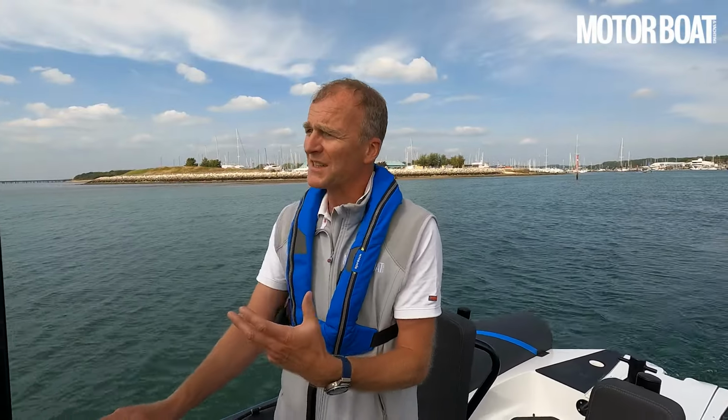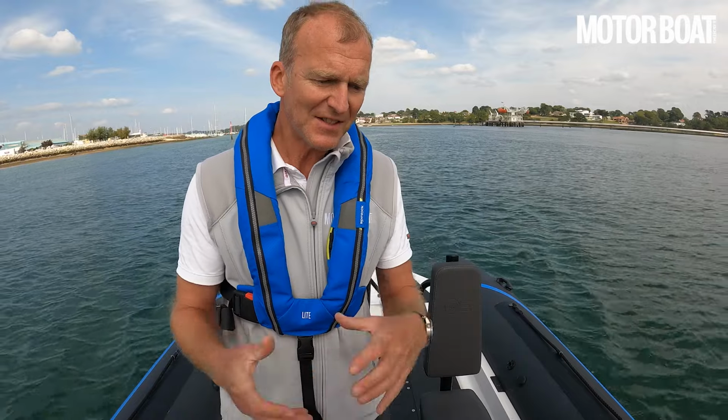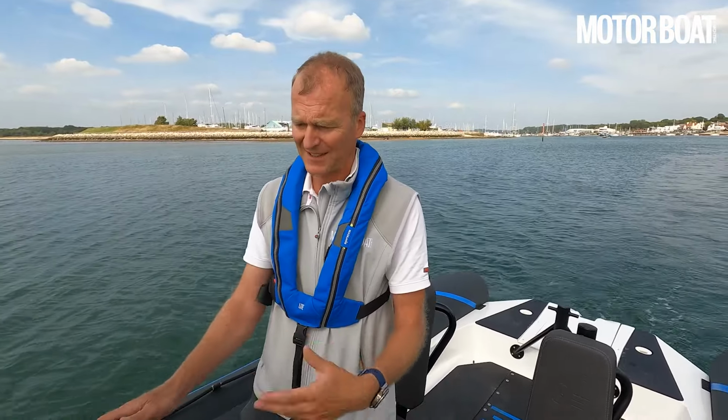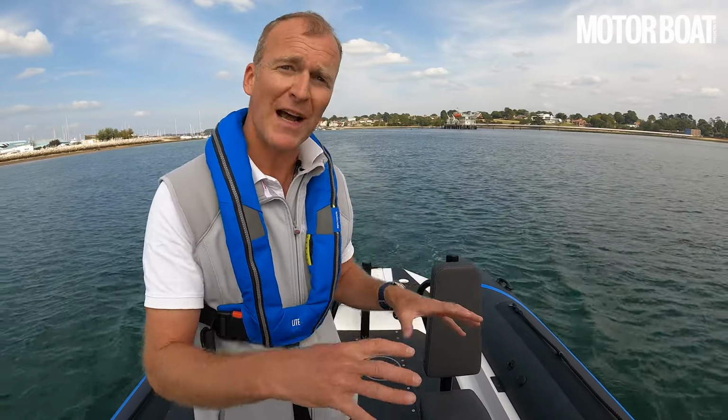So I know people are always concerned about the kind of range you get from an electric boat, but to be honest, the reality is it doesn't really affect you nearly as much as you think. Often when you're just using it as a day boat, you're not covering a huge number of miles, and there's certainly no danger of us getting anywhere near running out of battery. And the other joy is that if you've got a quick charger, this 63 kilowatt hour battery will charge in less than 2 hours, or you just plug it in overnight on your conventional marina berth and it'll all be done in 8 hours.